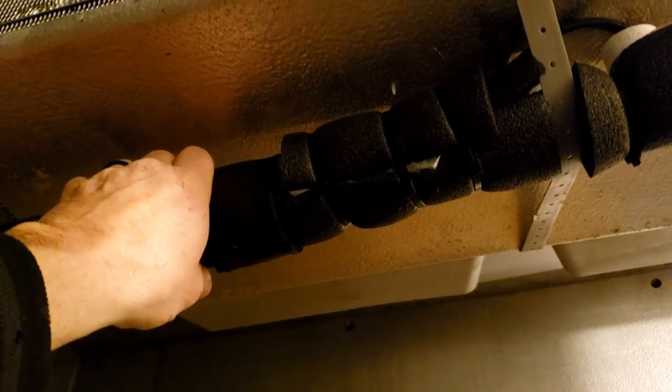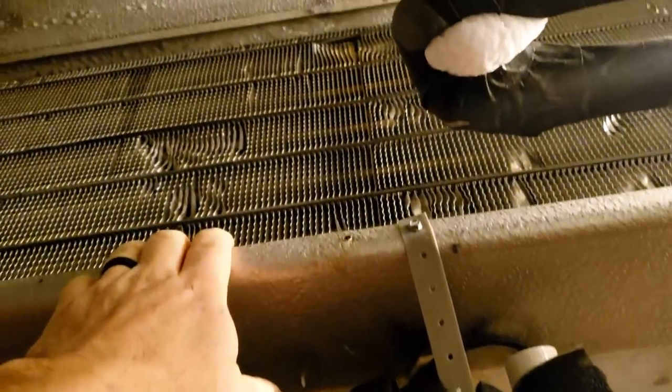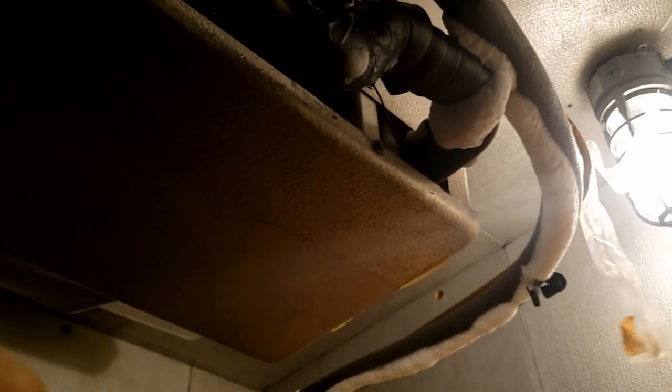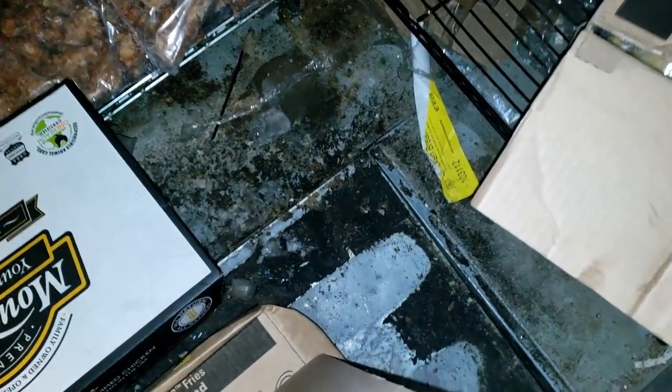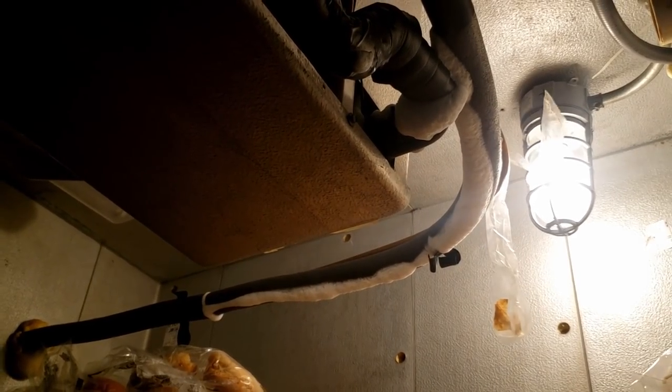Alright, so we're back — it looks like our drain heater is working. No ice buildup down below, nothing up here in the pan. We're coming back here to replace this lightweight insulation with some insulation that's actually rated for it. I don't see any ice down here on the floor, so we probably accomplished what we originally wanted — but that still isn't right, so we're going to correct it. We're going to throw this thing into a defrost so we can get that cut off.